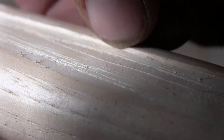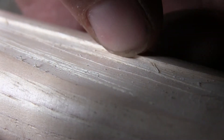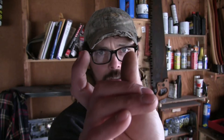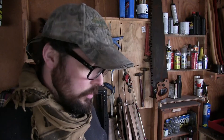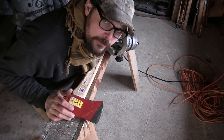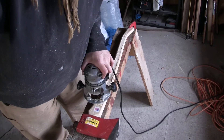You can kind of see the concept — I wanted to take out the center and get most of that material gone. This should be roughly a sixteenth of an inch out of the center on both sides. So let's say I took a sixteenth of an inch off both sides of that handle — the handle is still like this wide, and a good axe handle is like that. This one is like an inch and seven-eighths. It's stupid. So I think I'm gonna fire this router back up, set the bit way down, and just freehand off a pile of wood. Wish me luck, because I could just screw this thing up pretty bad. Freehand routering — it's a recipe for disaster if I ever heard of it. Let's give it a shot.